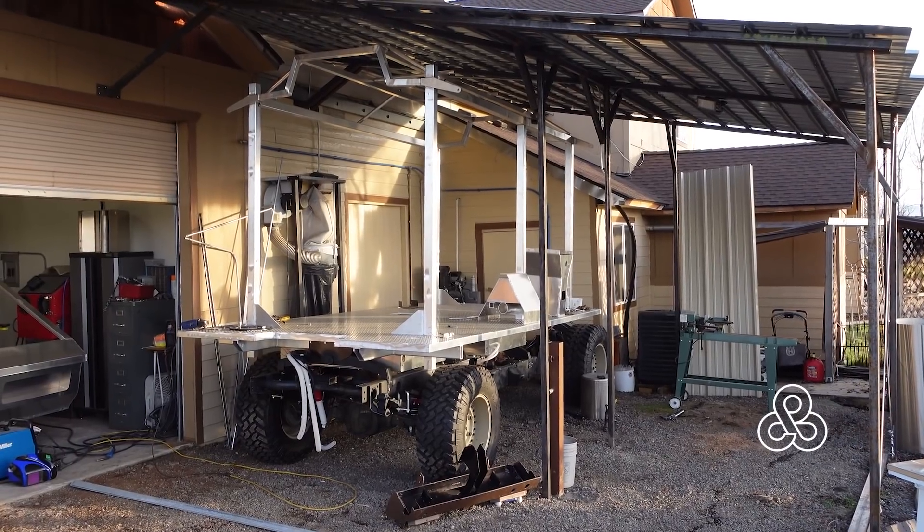Today is the day and we are out here with Leviathan. I'm leaning up against the cabin subframe which is now permanently — well, permanently is a little bit harsh. It is mounted on a three-point system that has the ability to be detached if you ever want to do that. We can take a look at that final attachment onto the chassis. That three-point system is made so that the chassis can flex when it's in off-road terrain without the cabin itself having to be involved in that flexing.